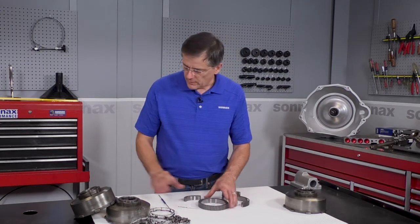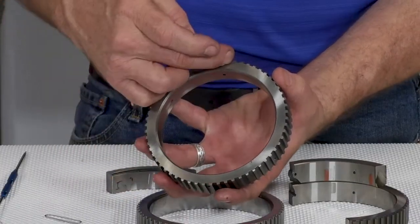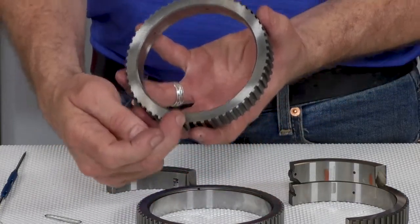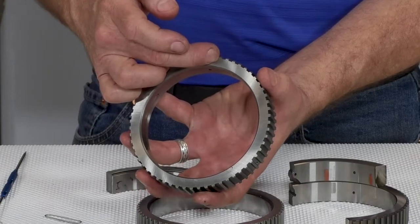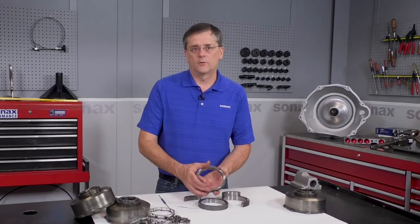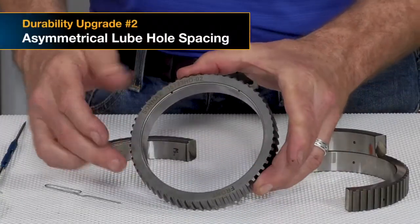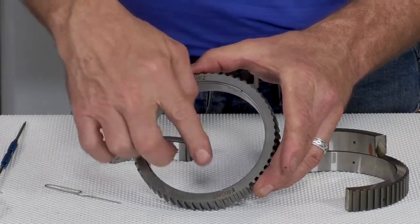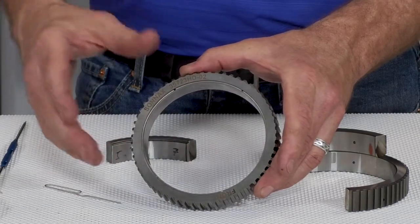With the factory races, they have the lube holes 180 degrees apart from each other. That means if you have a roller that ends up locking on one lube hole, you have another one doing the same thing 180 degrees across at the other lube hole, and that can lead to fatigue and flexing of the race and ultimate failure. With ours, we made the hole locations asymmetrical so you can only ever have a roller adjacent to one hole at a time, and you won't build up that flex and stress.